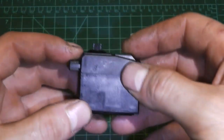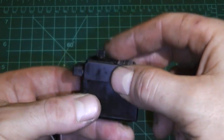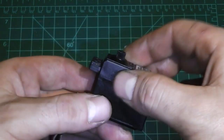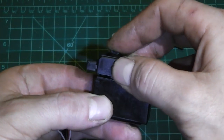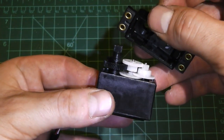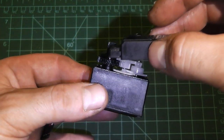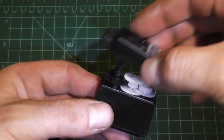When removing the top part of the case, you can remove the bottom too if you want, but I'll just keep that on so it's protected. When you're removing this top cover it's super important to push against the output shaft — when you lift this off, the pressure on the plastic servo case will help to lift the gears with it, especially on a cheaper servo. If you have a metal case you don't have to worry about that. Light pressure on the sides and a lot of pushing on the output shaft — be careful not to have the cover raise off with all the gears. Note that some servos have a removable post, some have washers, and some are bearing-supported with a ball bearing so there's no play or slop in the servo.